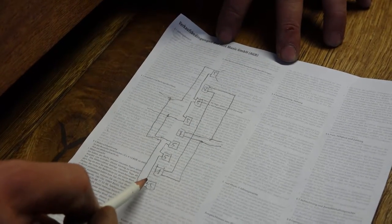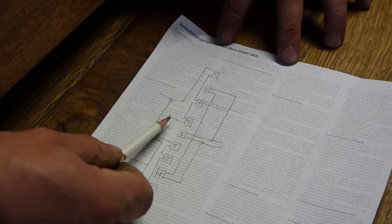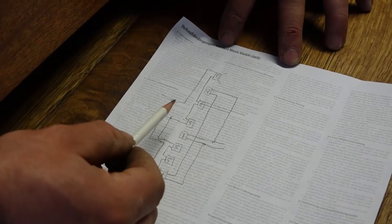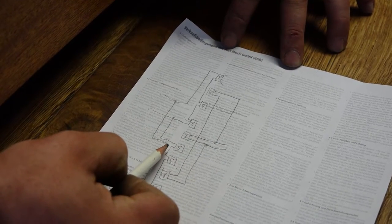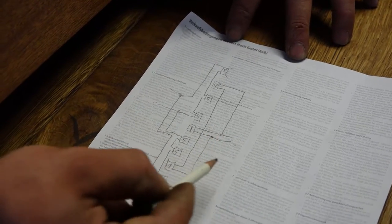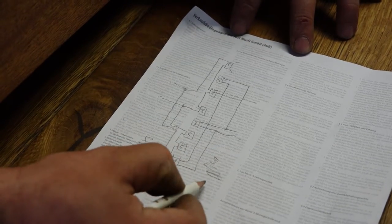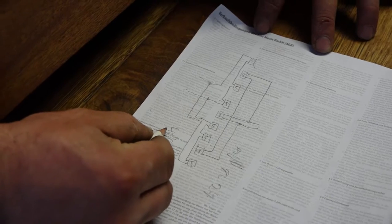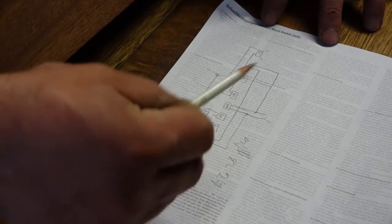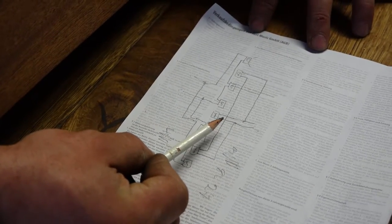On the low end frequencies, I connected 3 5 ohm in series, 3 5 ohm in series, and then I connected them together in parallel. So it means here we will get about 7.5 ohm, which is really close to the 8 ohm to drive via this amplifier. And because of this, the high end has higher impedance than the low end. Of course, on this amplifier we have 30 watt on this side, and on this side we have 40 watt. So here on the high end we will get about 27, something like this, and here we will get the original 40 watt on 8 ohm. As I told you guys, I tried the other one, I built the other one exactly the same way, and it sounds fantastic. Yeah, on its own quality level from the 70s, don't forget.